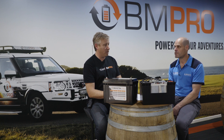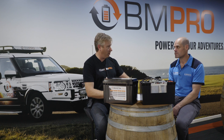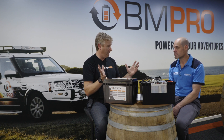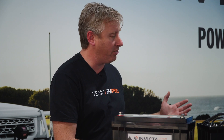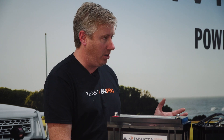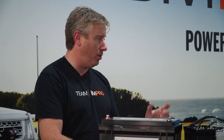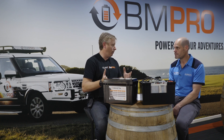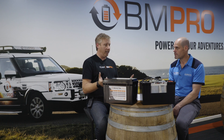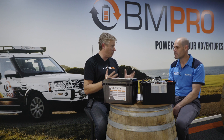One question we get asked is about inverters. I wrote an article recently in the 12 Volt Guru column about people who had a lithium battery and then suddenly, in the middle of the night, no power — their lights had gone out. They weren't aware of how much power they had been draining out of their system overnight while running an inverter. It's really important to match and pair the right size inverter with the right size battery.